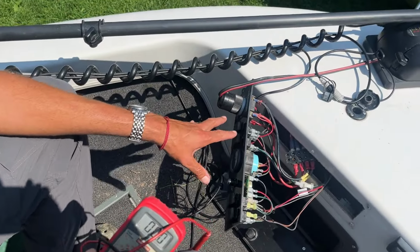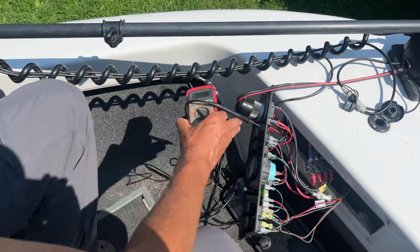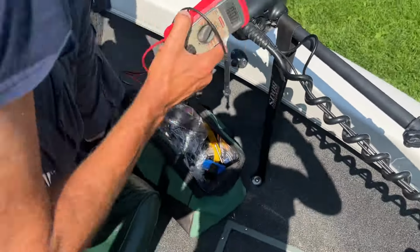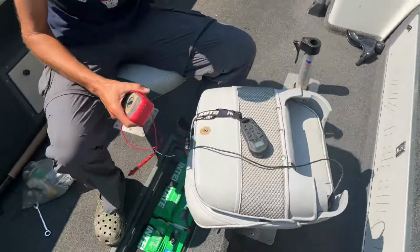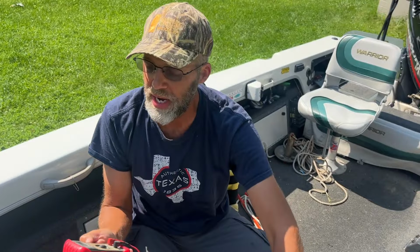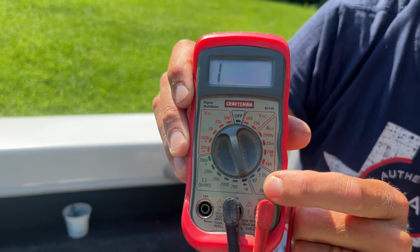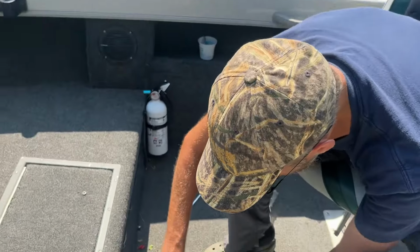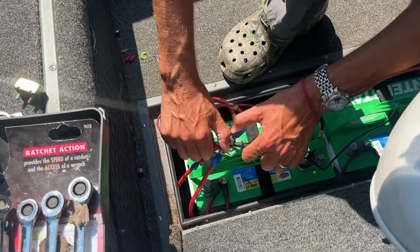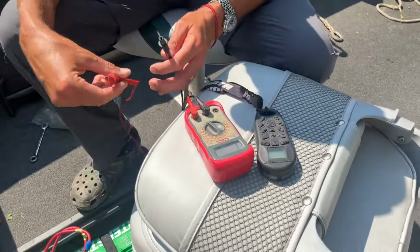So then I'm like, okay, there's gotta be something in between this panel and the battery. So then I went back here. Follow me, Jacob. And I've set my ohm meter to this setting, which will give me tone, okay? Tone, because you need to hear. So if I go across something with the ohm meter, I should get tone like that, and it should read 0 on the ohm meter, okay?